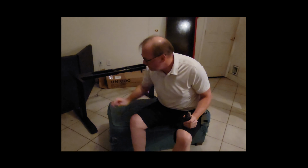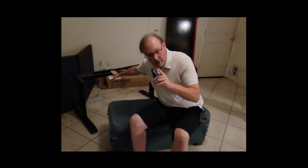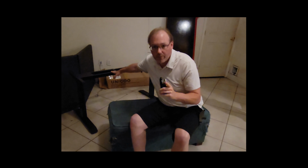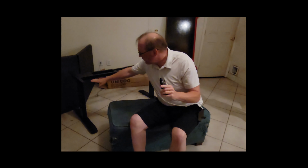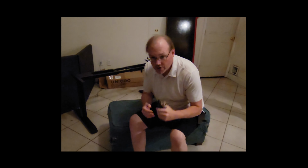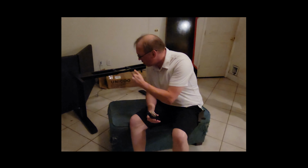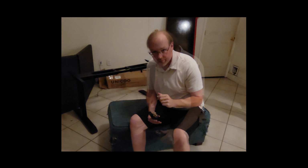I will note, lube all your bolts. Get some 3-in-1 lube, or shoot, even Vaseline would help, but put some sort of protectant on every single screw and nut that you use to put these together. Not everything's perfect with every single set of these legs. However, it saves you a lot of headache in case something goes wrong. When it's lubed, all the pieces fit together a lot nicer, especially when you're in a big manufacturing business, you run into little hiccups, like a bolt not being properly threaded or a hole not being properly machined. It happens.